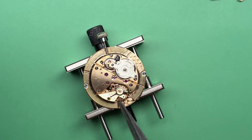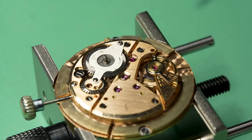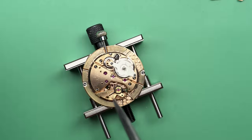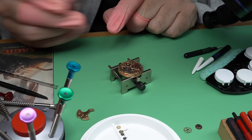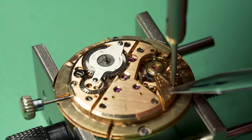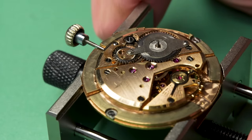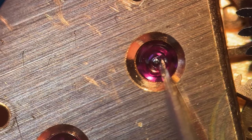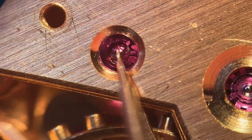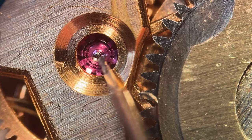Usually it's something horrendous, a much bigger issue. Let's see if it'll run consistently — a little bit of air. Okay, it did slow down a lot. I blew air on it to see if it would go, and it did tick for a while there, but it does seem to have stopped. Let's see if I can get it running. I think it's actually running — nope, it stopped again. One thing we can do here is oil the jewels. These are running dry and haven't been oiled in a long time, and that means there's a chance we just need to lubricate this watch to get it running properly. So let's just do that and see what it does.